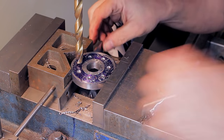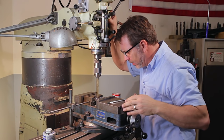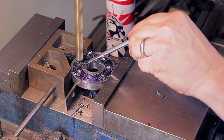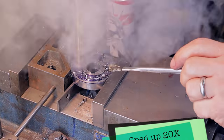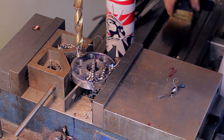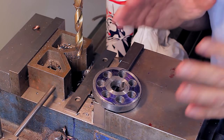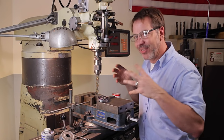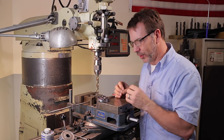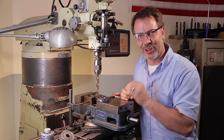There we go, that's the beginning. Now we're going to drill this all the way through — that means the parallel is of course going to be in the way, so we don't want that. That's how easy it is to do a bolt circle without having to set everything up. I also know a lot of you guys don't have dividing heads or rotary tables — here is a great solution, and for you guys that are a little more on the lazy side and don't want to pull out those extra tools, this is also a great system.